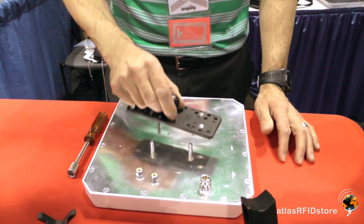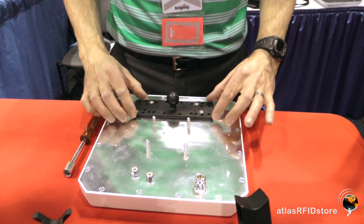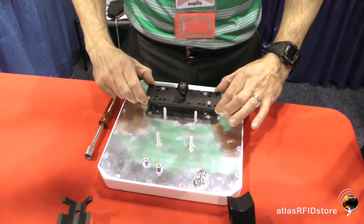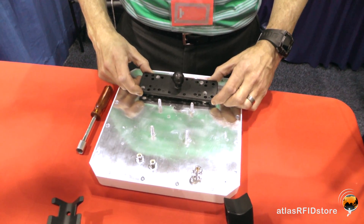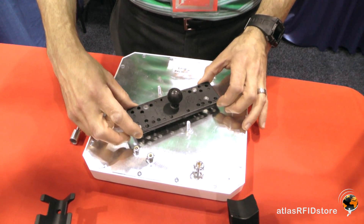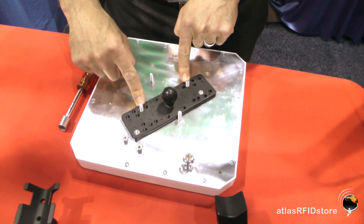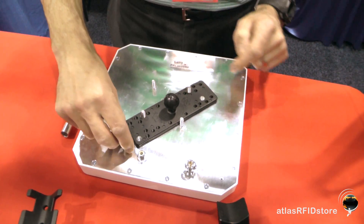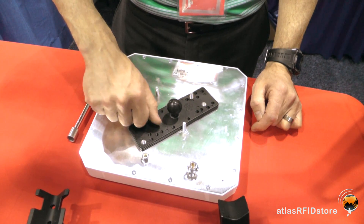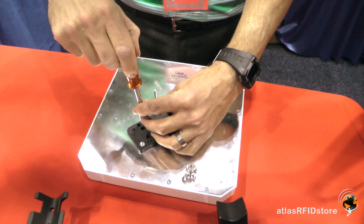The biggest concern when we send these out in the field is that people don't understand exactly how they're supposed to work. They see four mounting studs and know this mount can't possibly fit on all four. In our data sheet we specify this, but we thought a video would be the best way to get our point across that you've got to make sure you're using the right set of holes. In this case, you're going to put the mount on diagonally, taking advantage of these two holes here in the antenna plate, using two hex nuts and a seven-sixteenths socket or wrench to secure that down.